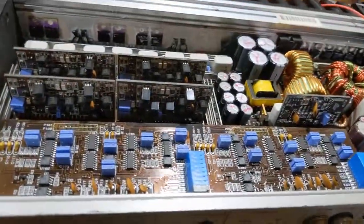It is four channels, so the quiescent current is going to be a little bit higher than normal. She's climbing rapidly — there we go, it's kind of settled down a little bit. So let's get the heat sink on it and then we'll put it back in its case and do a test. Hopefully it's all good.